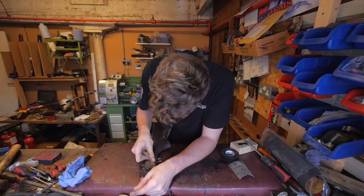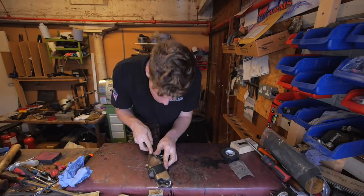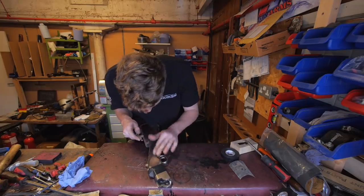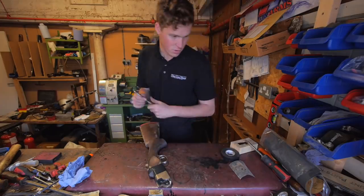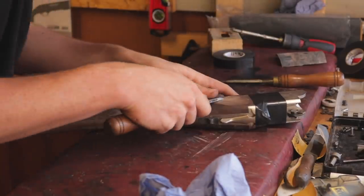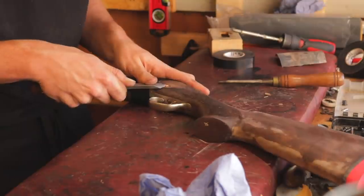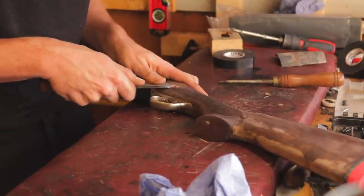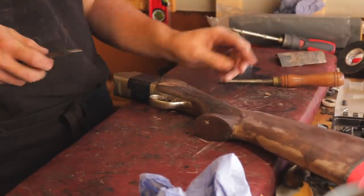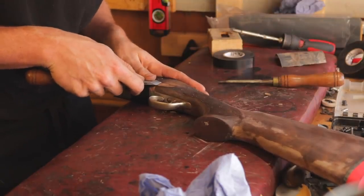Vastly different, actually. So what I'm going to do, I'm going to break some cardinal rules here, and I'm going to chisel out at this stage. I'm just going to remove a couple of really nasty high spots. I'm going to get the adult size chisel, this one right here. Go with the grain of the wood always. Find the grain of the wood. For anyone who's ever done green wood carving, it's a similar concept. Once you've found an easy way to cut, don't fight it. Go with it, man.